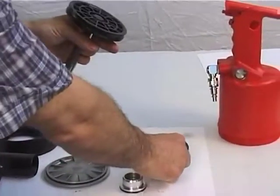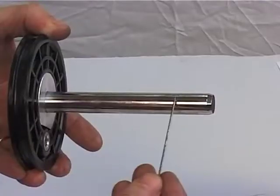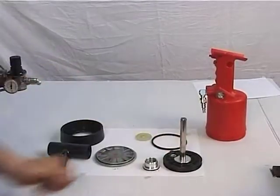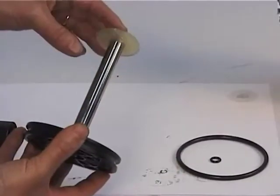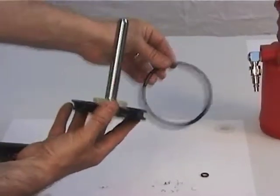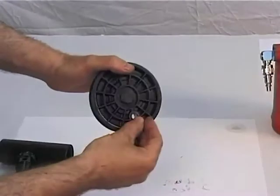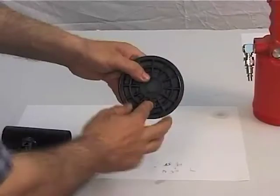Before remounting the piston, check that the stem roughness, figure 77, is 0.2 Ra. Check that the stem screw, figure 82, is well fastened with Loctite number 270. Then insert the dampener, figure 76, with its raised part facing towards the piston. Now mount the outer and inner O-rings back in their seats. Warning: always replace the seal, figure 25, when overhauling the tool.